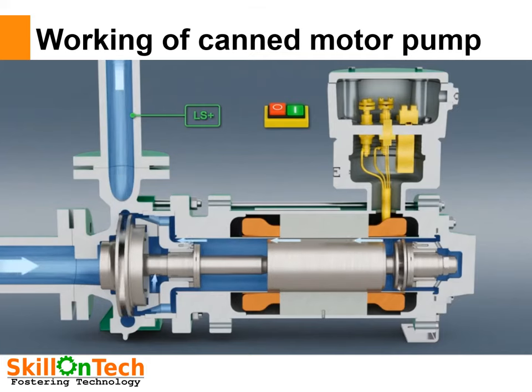These pumps are made up to 1000 m³ per hour capacity and produce up to 250 bar discharge pressure. Generally 415 volt, 3-phase supply is required, and the RPM range is generally 1500 to 3000 RPM.